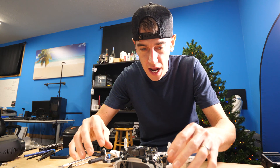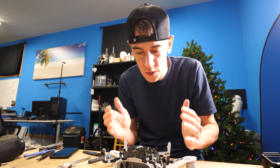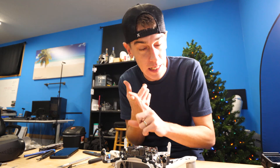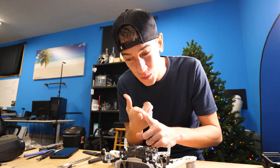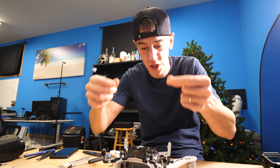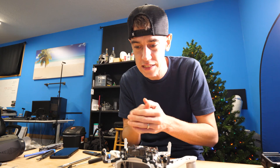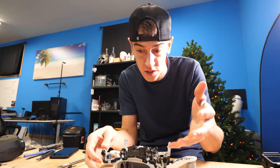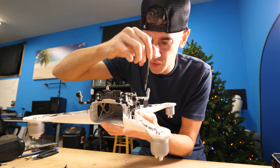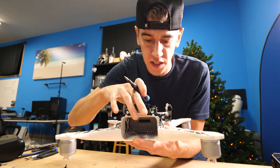The motors are attached and soldered to the left and right side boards. The only way to get to the GPS module is by either snipping your motor wires on two sides so that we can lift up this whole unit and fold it back, or if you're good enough at soldering, you can desolder without clipping any wires — which is what I'm going to do. On the four corners of this big box there's a screw at four points. It may be covered with silicone, but you need to get those four screws out so we can lift this up a little bit.